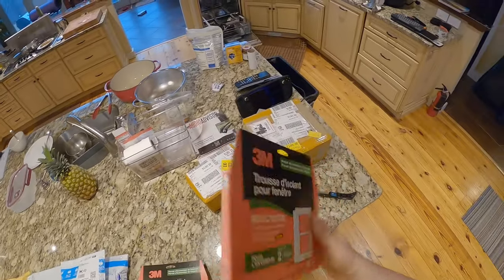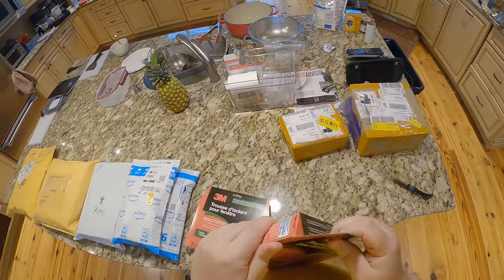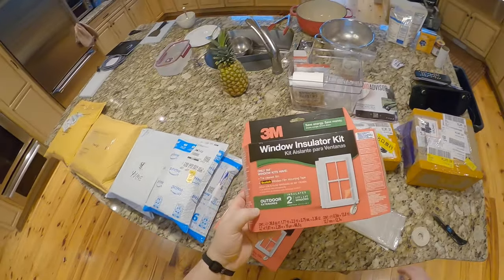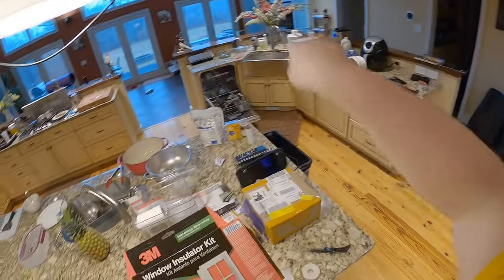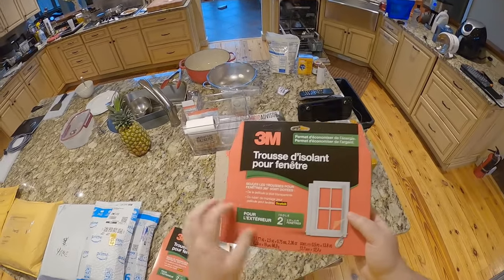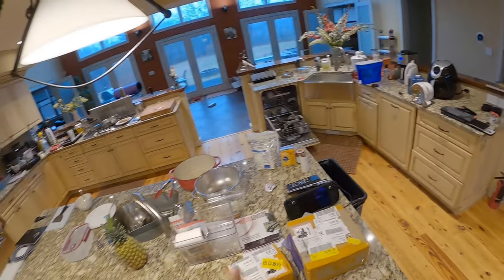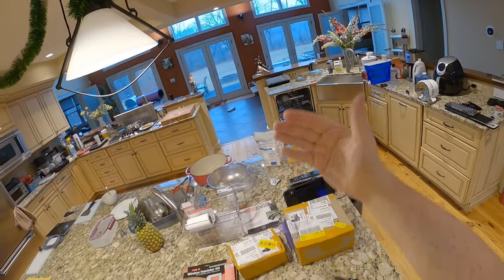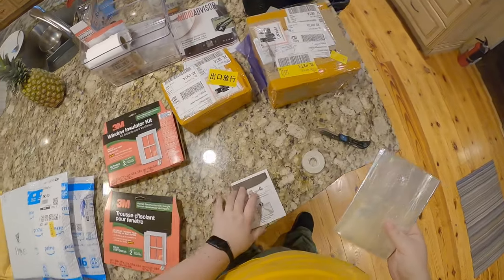These are window treatments — I'll open one up and see what it says. This is for the basement window. So now that I've got the mini split down the basement, this was fourteen dollars and claims you can do two large windows. Outdoor exterior insulators, the clearest film, Scotch window tape. Basically you tape around the window, you apply this, and you put a hairdryer on it and it shrinks and it gets full tight. It blocks drafts. My basement windows are only single-ply glass.